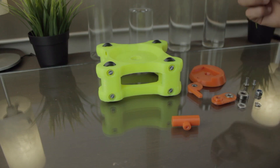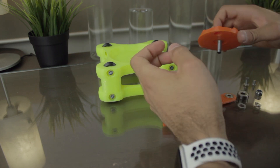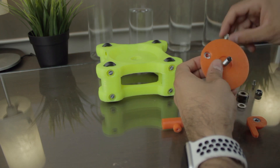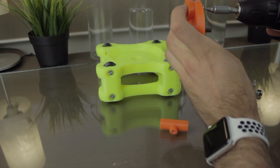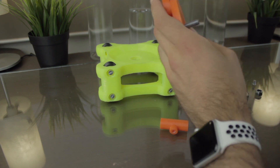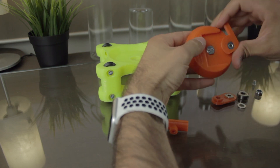So finally, once we have all the components ready, I'm gonna start with assembly. First I'm gonna pick the camera mount and insert the biggest bolt in place. Next we'll embed the M6 nut in here and in the camera mount. We'll put the locking washer and the M6 screw. Then we'll assemble everything together and tighten the screw all the way through. Maybe it's too tight, so I'm gonna release a bit of pressure, and as you can see now we can move it perfectly.